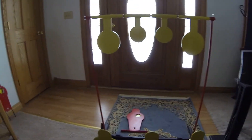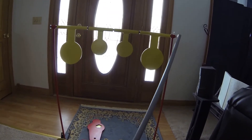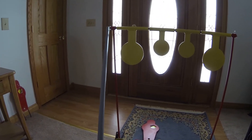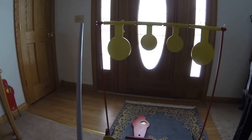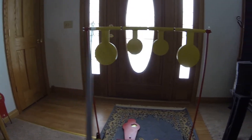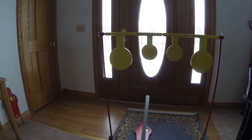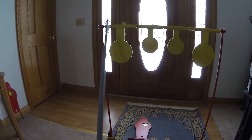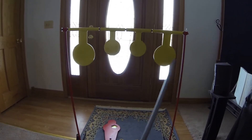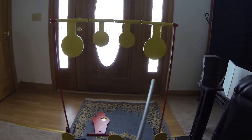What I like about this whole setup is it's totally modular. If you see this cotter pin right here, you can take that pin out and slide this pull out — it's got a washer on this side so it can't come all the way out — but you can slide that out, drop out all these targets, and switch out for one big gong or whatever you want. If you decide you want to shoot AR400 or AR500 steel, you simply pull the bar out, switch out your plates to the desired steel, slide the slider back in, and put your cotter pin back in.